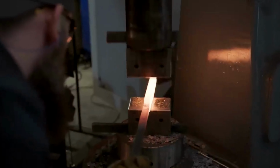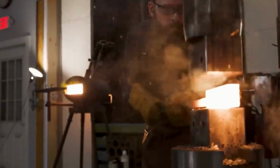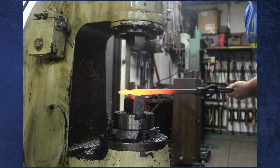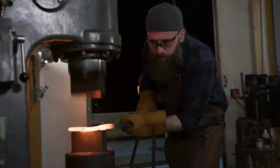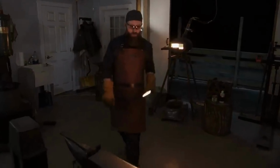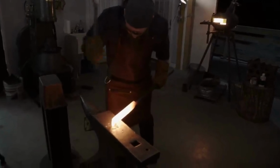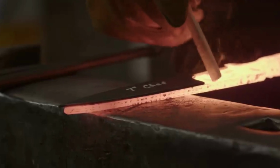Transitioning to a traditional Damascus wave pattern, Zach elongates and thins the bar using a potent power hammer. The significant investment of $20,000 for the larger power hammer is a fraction of the over $100,000 spent on specialized machinery. This expenditure underpins Zach's capacity to produce superior Damascus knives. After forging the blade's tip, Zach cross-references it with his template to ensure precise adherence to design.